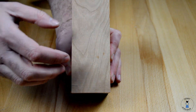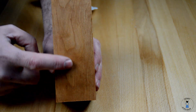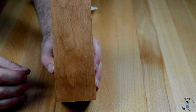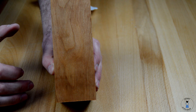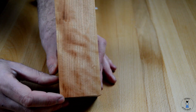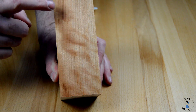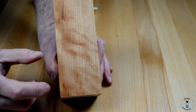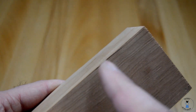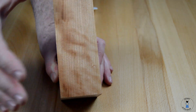The grain is quite wide — I'll turn it round. I've pre-wetted it so that you can see the grain there and you've got those lovely lines. Cherry can be a gorgeous wood, absolutely stunning wood, and it's used an awful lot in furniture for that reason. On the side grain here you can see where I've highlighted it — you do get these black marks, these black speckling through Cherry. When you put finish on Cherry, over time it will actually darken down quite a lot, so those black specks get hidden.